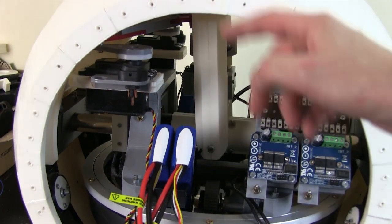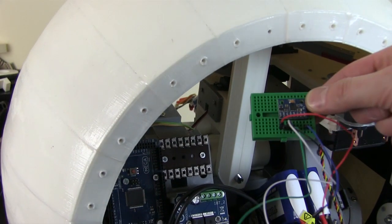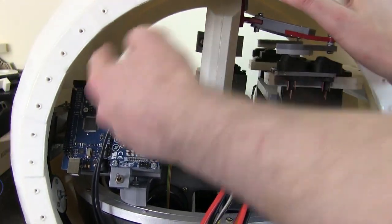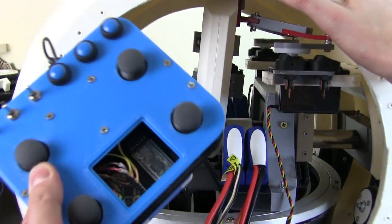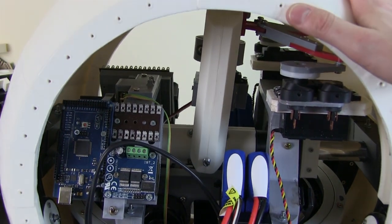So I need to wire these up, put some fuses in, then write some code that will talk to the inertial measurement unit, which is the MPU 6050. That's going to be fitted right in the middle. Then we can use the Arduino to read this, read the sticks, and hopefully make everything stable. That is the challenge today.